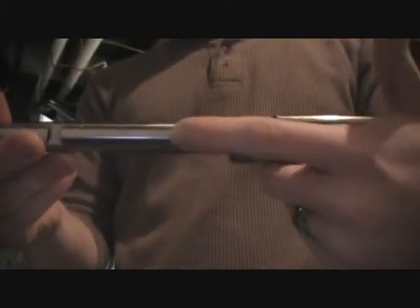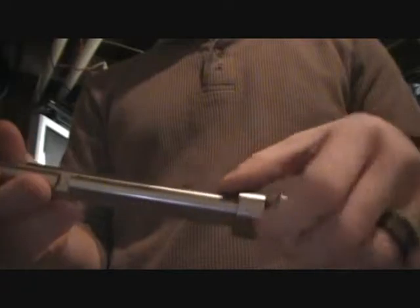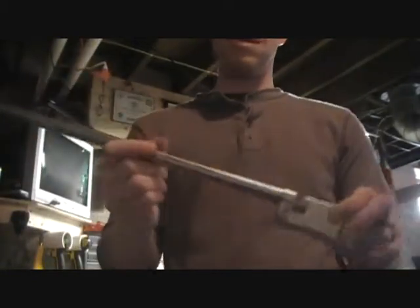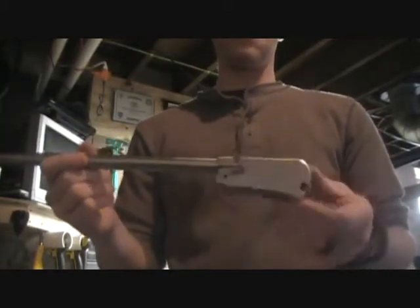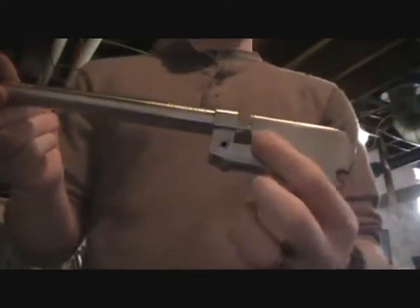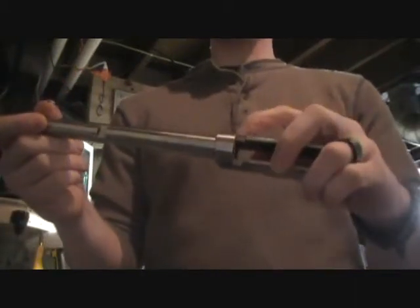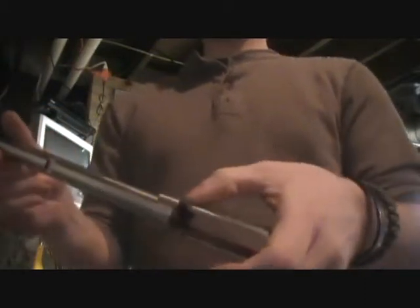If you want to take a closer look at this just to see the finished product, you'll notice some stuff on it. Like these little nicks right here in the barrel — those are smooth but they are nicks. I'm not going to try to file those out just because this gun is so old. It is a family heirloom and little things like that is what makes it look old. The same with the frame here — it's got little ping marks in it. Back in the day when this gun was made, they would build the gun and if the firing pin carrier didn't fit perfectly, they would take a punch and ping it, which expands the metal and makes it fit tighter. I want that character to remain in this firearm when I'm finished with it.